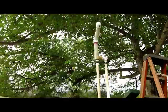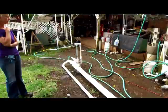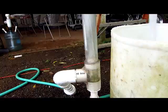The water comes down here to the reservoir, goes to the far end, and comes up there. At that point we have a 120-watt pump delivering 120 liters a minute. It pumps down here to what we call the turbo blaster. With the turbo blaster, the water comes up the center, then we add air around it.